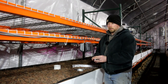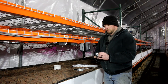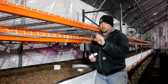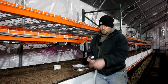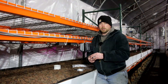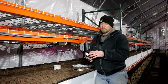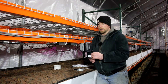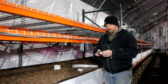If the overflow drain doesn't work, I'll just turn off the valve to that bed. Also, something I learned last night: my server code doesn't currently have a way to tell the system how long to run a fill cycle and thus what water height to target. I need to make those updates on the server side — create the HTML control page, the database field, and update the Arduino code to fetch and use that value. Not doing all that tonight though.